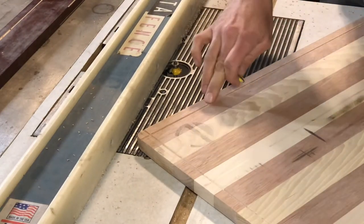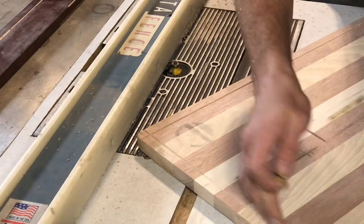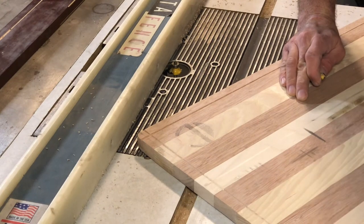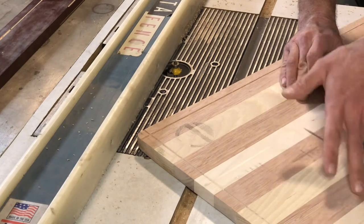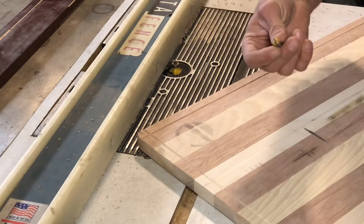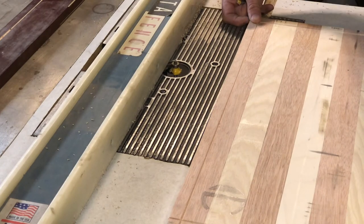I got all four of my boards. This is a drip edge — I call it a drip groove. I went ahead and I like the design just going straight through, and it's a heck of a lot easier. This design isn't digging deep into the wood and it's more for accents, but it does make it nice — if someone uses it as a cutting board or something is dripping on the charcuterie board, you'll hit these edges and it keeps it from rolling off. Obviously if it's a lot of liquid the edge can't handle it all, but I believe that's a quarter-inch V-groove bit, set pretty shallow — I just wanted to make a nice attractive line and give some character for when the oil gets rubbed on.